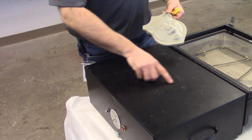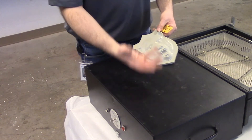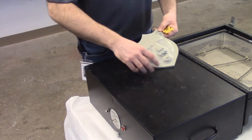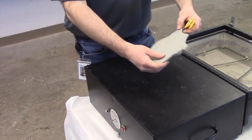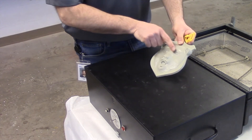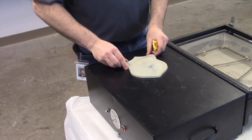You can see on video that there's a whole bunch of little holes in the table. It's almost like an air hockey table, except instead of air blowing out, there's going to be a vacuum sucking down. Most of our molds also have holes drilled in them so we can draw vacuum pressure at the lowest points in the mold, sucking the plastic sheet around our mold.